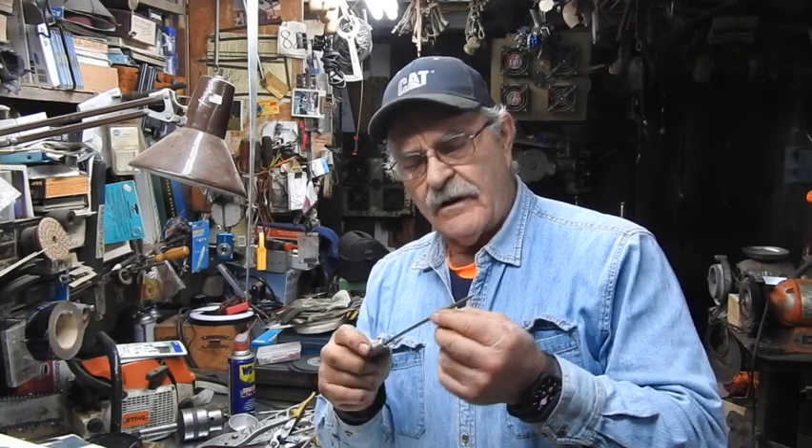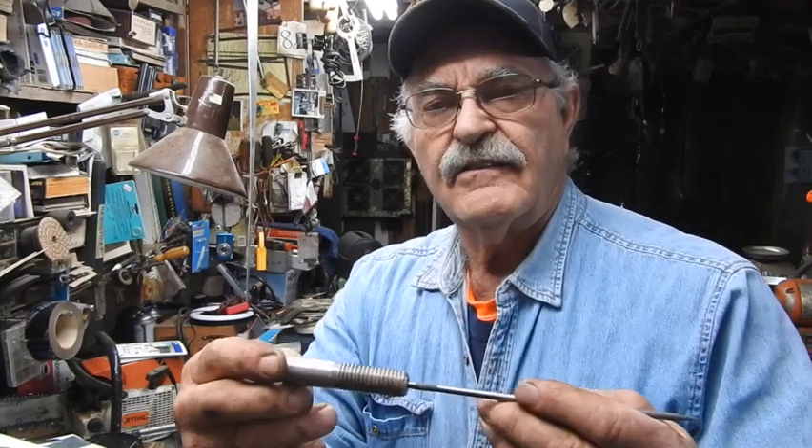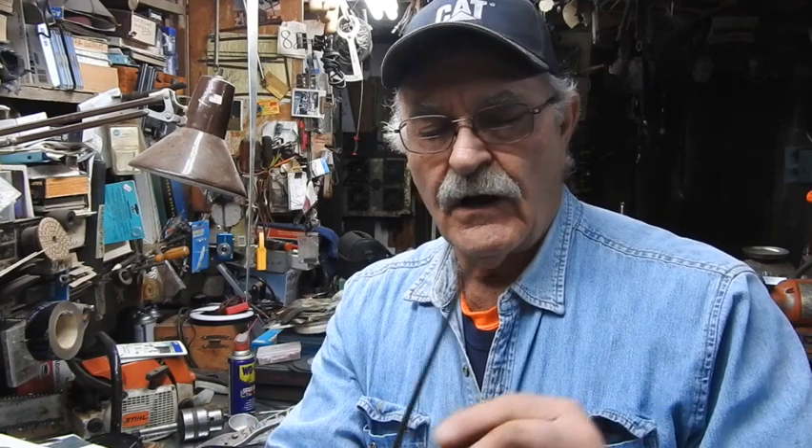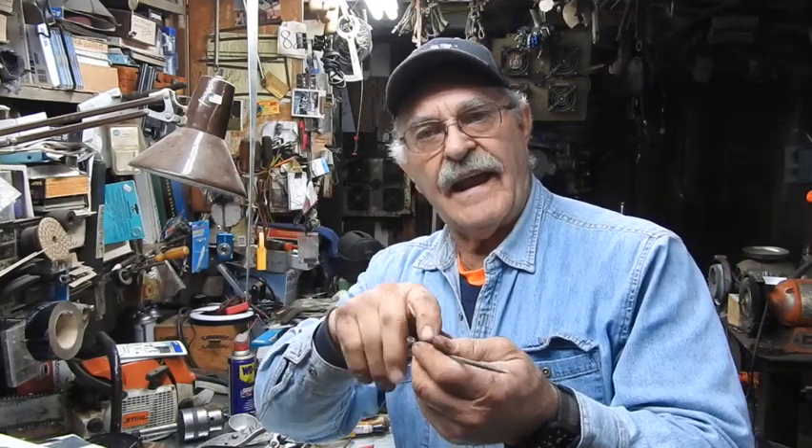Talking about scribes — I did a whole video on it. I never edited it and put it up, but I've got a whole selection of scribes. Different ones are used at different times. I use an ice pick a lot too, because reaching all the way across a four-foot piece of metal, the ice pick gives me extra reach to start my scribe line. This one here is nice and long like an ice pick. I found some little round rod in an auction box that was a good hard material, sharpened it down to a point, took an old 5/8 bolt, cut the end off, shined it up on the belt sander, drilled a hole just to where this fits with a press fit, chucked it in a vise, and drove it down. Got myself a handle so I don't jam it into the palm of my hand. This is the one I use quite a lot — just a little scribe.